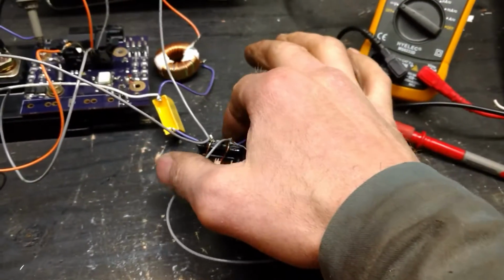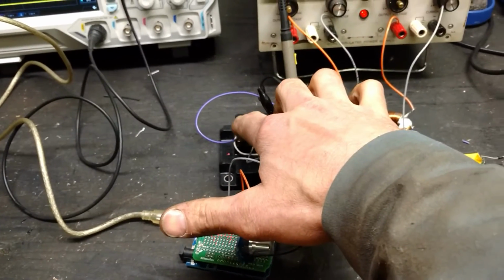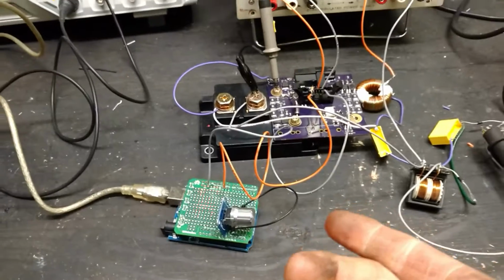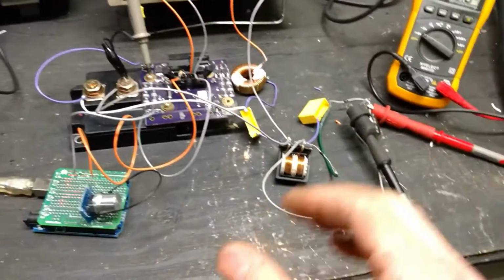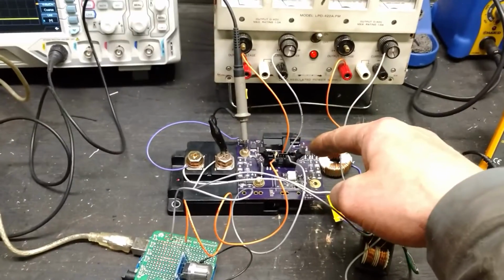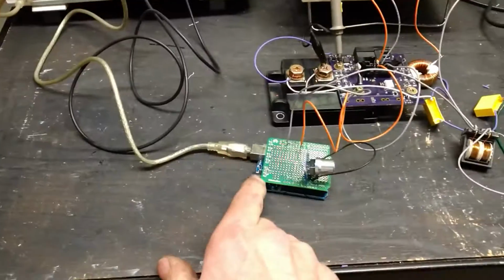That's set up. The PWM is going to be between emitter and collector on the IGBT. That's a 600 amp 1200 volt IGBT. It's overkill for this setup. I'm just using it because I have the driver and everything convenient, ready to go. This driver even has DSAT detection built into it. Power in my Arduino from my oscilloscope, kind of just handy.